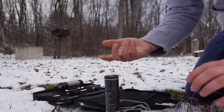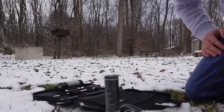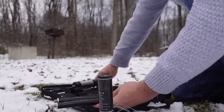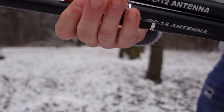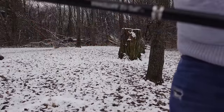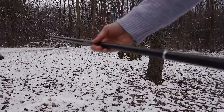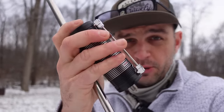Looks pretty good. We spread out our radial wires evenly in each direction. Then we take all four extension pieces — also made of aluminum — put them together, and screw them onto the SO-239 connector. I'll be right back. The quality on this thing is pretty remarkable for aluminum; it seems like good quality material. There are four elements to this extension piece, and now that we have each on, we install it back on the SO-239 connector.